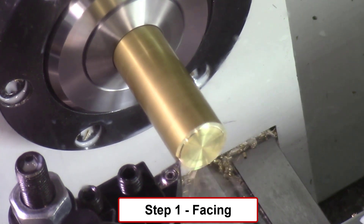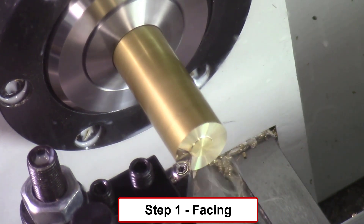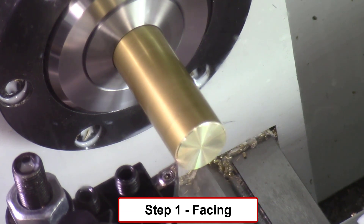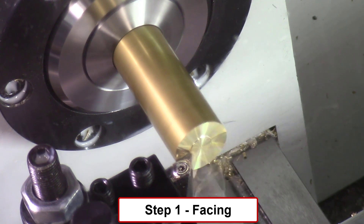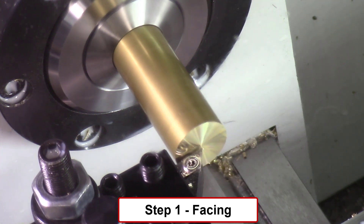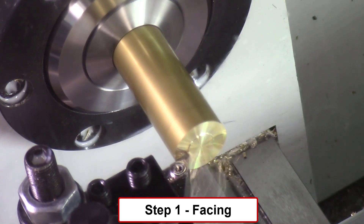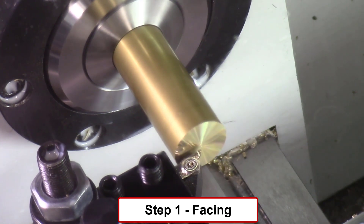In this section of the video, I'll be demonstrating the turning of the brass bearing in real time. I did not speed up this section of the video, but I did cut out the time for the tooling changes. I'm starting out with a brass bar which is about 12 inches long and three-fourths of an inch in diameter, clamped into a three-quarter inch 5C collet chuck. This first step uses a left-hand facing tool to face off the front face of the brass bar. I face it off in several steps, with the third and final step only turning off two-thousandths of an inch to provide a smooth surface finish.